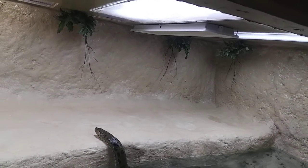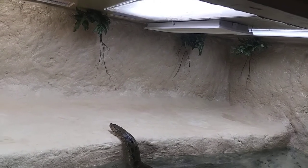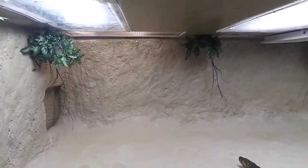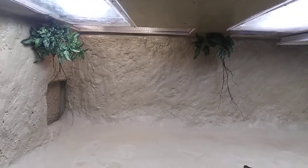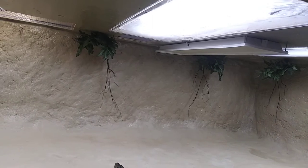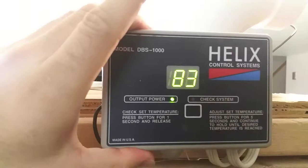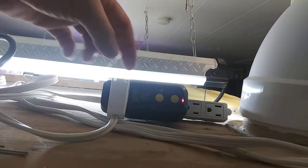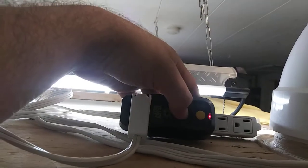The enclosure is heated starting with a backup ambient heater that only kicks on at night or during a power outage, because the shortwave infrared heater — that red glowing thing — turns off and needs to be reset with a little remote when the power goes out. Through a little system I set up, once the power goes out and the control system refreshes, it turns on and hits a switch, activating the cord to the ambient radiant heat panel.